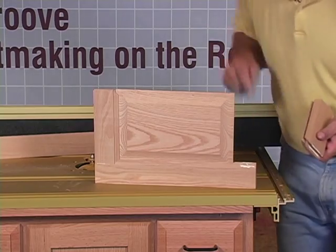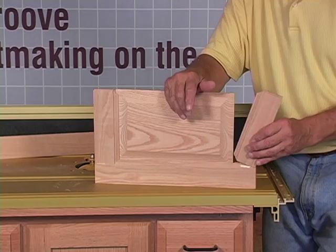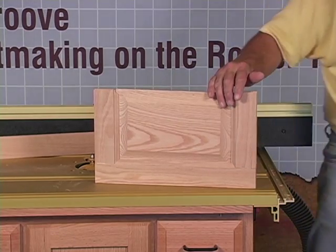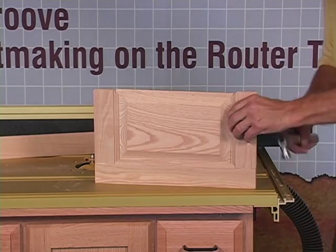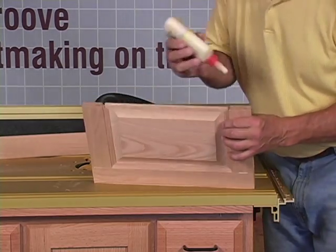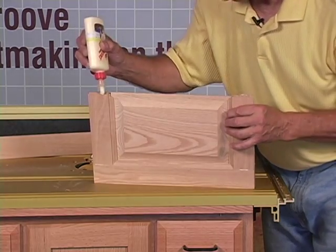If you do get some glue, and it does cord out in here, and you probably will, I still do, what works good for getting that glue out of there is white vinegar and water. Mix it up 50-50, and it does a great way of eliminating that glue. Okay, put a little bit here and here.